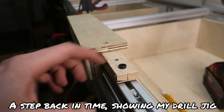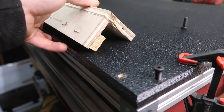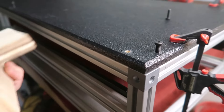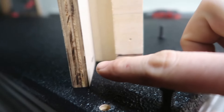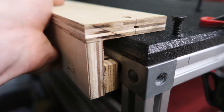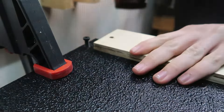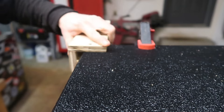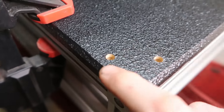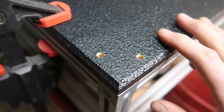I've got a few holes drilled and this jig is working absolutely awesome. You can write with a pencil on the extrusion and it erases, so I'm marking where I want the holes. What I've done with my jig is make a sharpie mark that lines up with where the hole is, so when I go to drill I just line up the sharpie mark with my pencil mark on the extrusion and the hole ends up exactly where I want it. The holes come out super clean — I was worried about it pulling up the raptor liner or chipping it, but I let it cure just long enough.